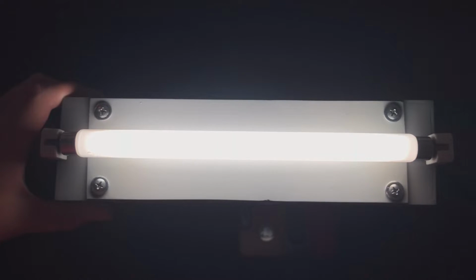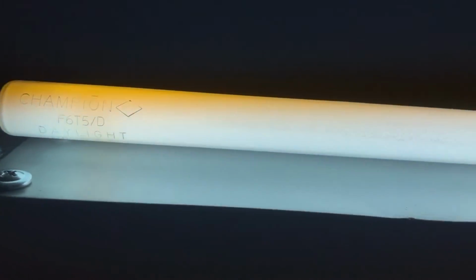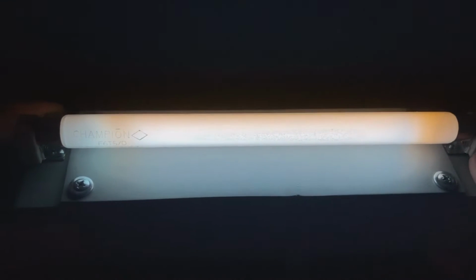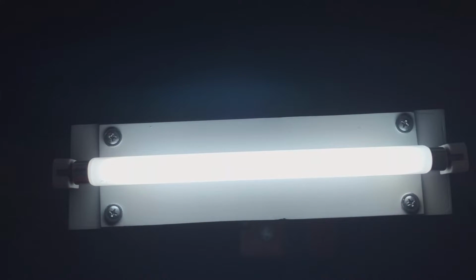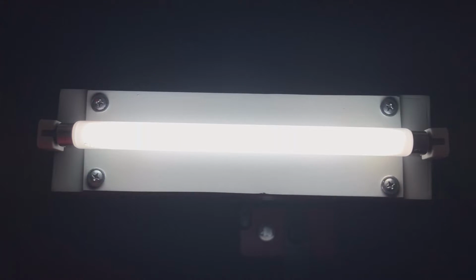It's not particularly long, but it is a pretty flickery startup. Well, anyway, let's go ahead and take a look at the bulb in action. Of course, you can see the yellow flicker band there from the halophosphate daylight lamp. Of course, halophosphate has a phosphor decay that is yellow in color. A triphosphor would have a light green phosphor decay, and a deluxe halophosphate would have a dark green phosphor decay.